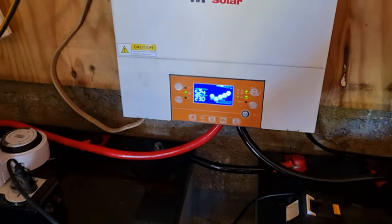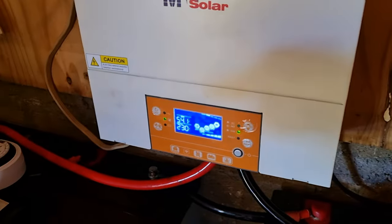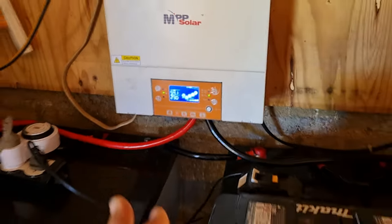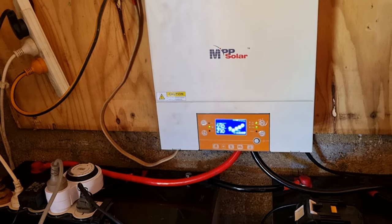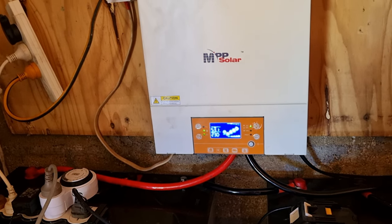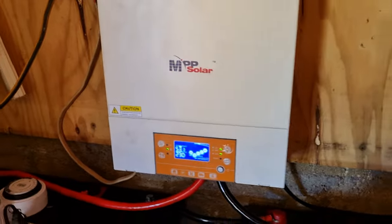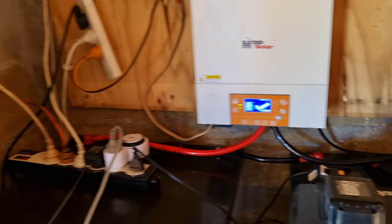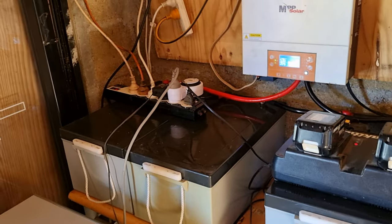So I think it might be a bad battery, but I've just swapped those over, so we'll see. If this one goes to 10.5, then that means there's something wrong with charging the system. I don't know if it's the settings — I've got equalizing every three days now, because it was on 30 days. There was no equalization at all until I set it. I wanted to do it every three days just to make sure that my batteries are maintained with the cells inside.